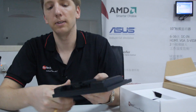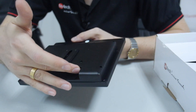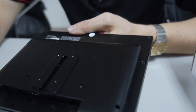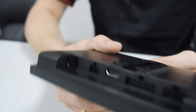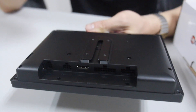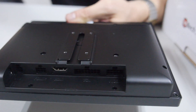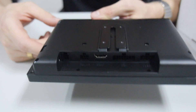We have a large number of connections. We have HDMI, VGA, and video inputs — three video inputs: two composite video and S-Video. There's a serial port for touch and a USB port for touch which also works as a USB hub. On the power side, we have an extended voltage range from 8 to 36 volts, plus ignition control and back-view camera control — for example, when you engage reverse gear, it automatically switches to video input 2 and displays the rear-view camera.